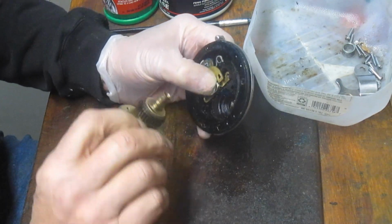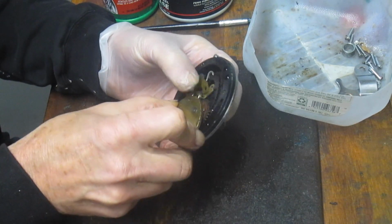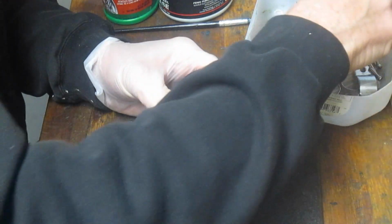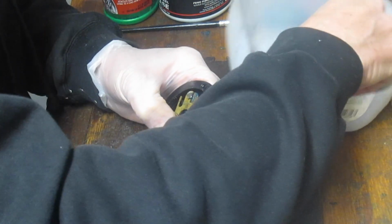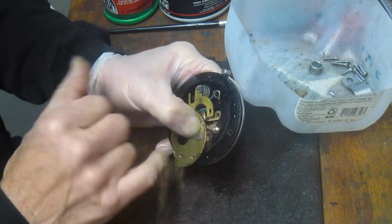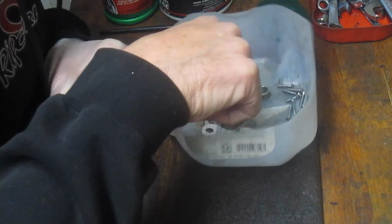You press down on the assembly here and you turn your bridge plate at approximately perpendicular to that. You grab a full threaded screw from the bridge and insert that into the bottom corner. You take the anti-reverse dog, which points up and sits like that. Then you look for that little spring that belongs in here.